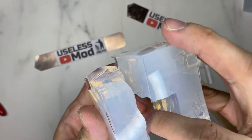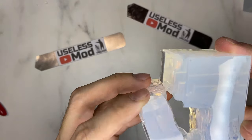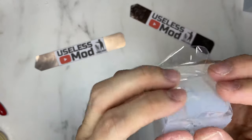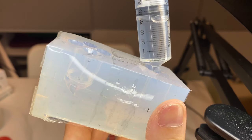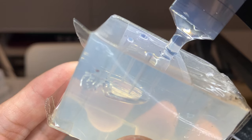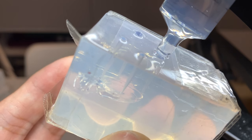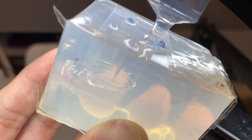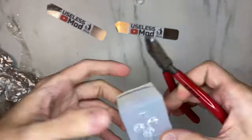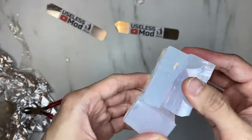You can see the inside part that makes the hollow shape has to be shoved into the part. The next step is to use tape to secure the mold since it's two separate parts. Now comes the resin pouring — I use a syringe because the part is a bit too small, so I need to apply some force to squeeze the resin into the mold. You can see the clear resin slowly squeeze through the gap. After the resin has dried, we can take out the part — first remove all the runners, then open the mold and take out the parts.